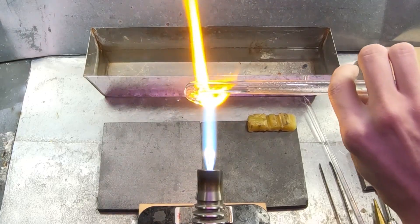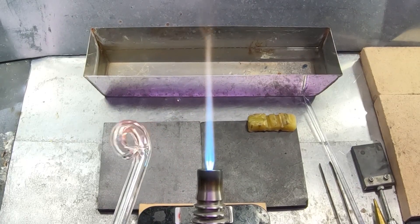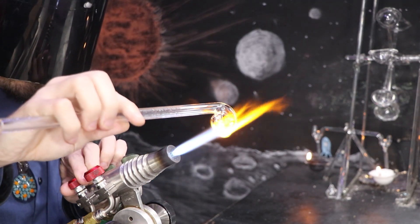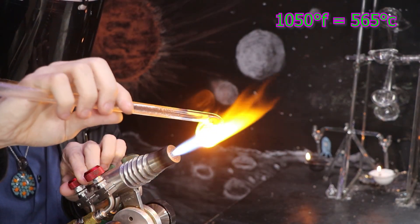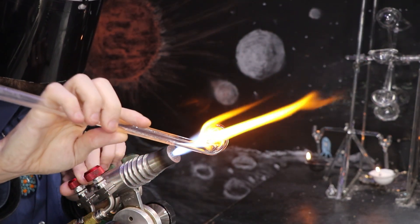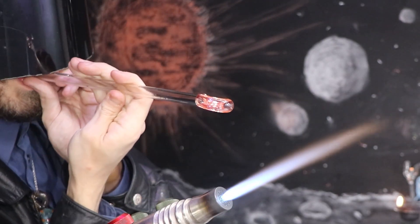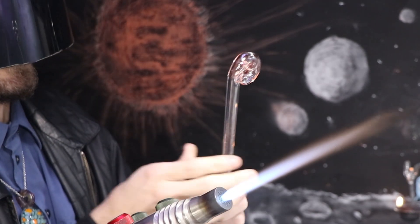We should see some pretty good results, as air has a very high rate of thermal expansion. It's good to note for glass working friends: when you put a vessel in the kiln at 1050°F — which is the normal annealing temperature for borosilicate — the air inside will expand to twice its volume. So when you remove it from the kiln, the air density in the vessel will be half of what it will be at room temperature.